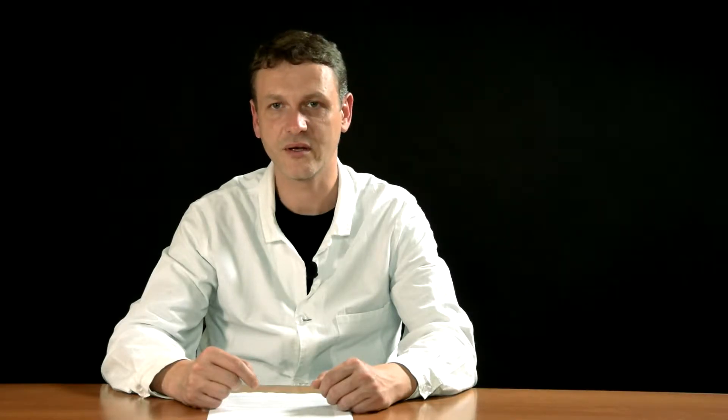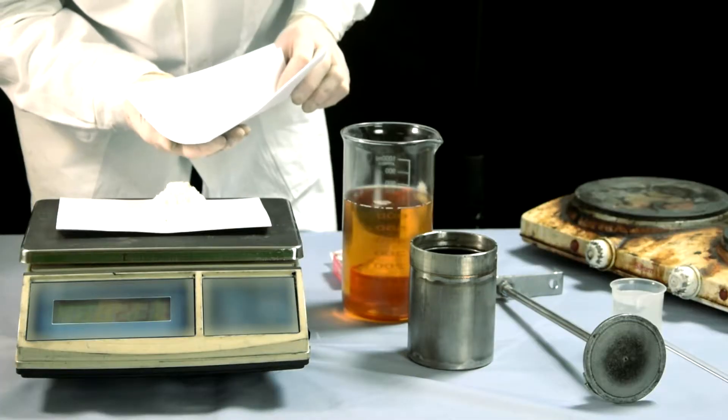For better visualization, we prepared and mixed grease in a 1-liter lab container, using the following ingredients to make 1 liter of the product: a 26% oil-lime suspension, industrial oil, and C20 fraction fatty acids.